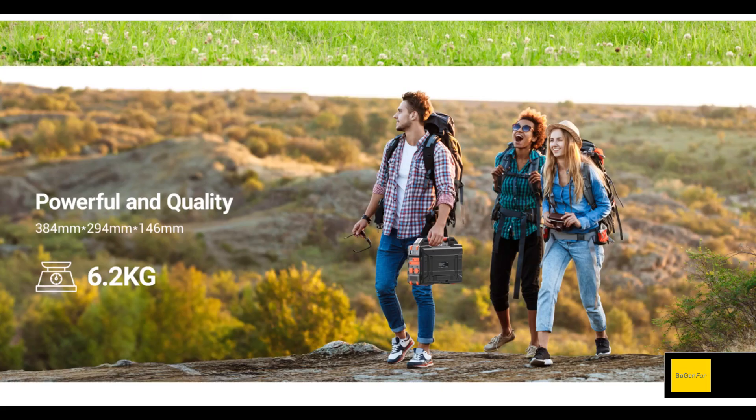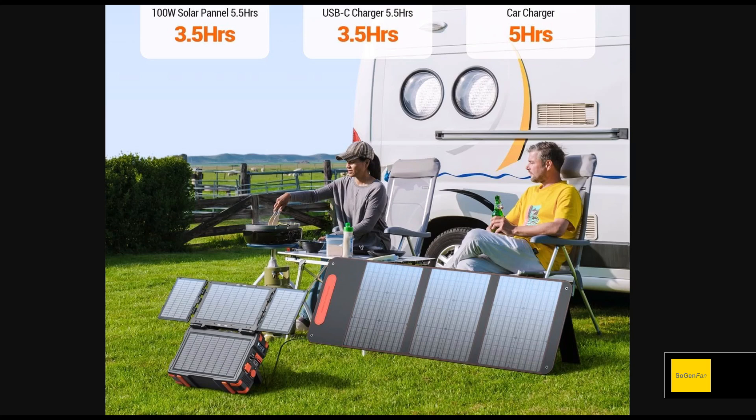The downside of a built-in solar panel is there are a lot of trade-offs, but this Browie has a huge advantage when it comes to solar charging capability. You can dual-charge this thing from solar: you have the 30-watt built-in panel, and you can also connect a 100-watt external panel simultaneously. But it gets even better — the Browie actually has a bi-directional USB-C input as well, so if you can find a compatible solar panel with a USB-C output, you can potentially triple-charge this thing from solar.